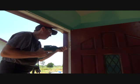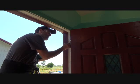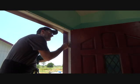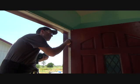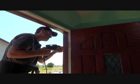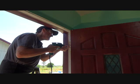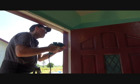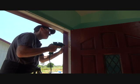Make sure you put them in the right holes, because we don't want to put them in any of these other four holes. And if you're thinking, hey, Joe, why not just take one of the screws out and ram a screw into here and be done with it? Well, you can't suck this jamb in far enough that way. We want to shove it in as far as we can, so that's why we're doing it on the back side. Then you won't see these screws. Make sense? I don't even care what color these are. I want to make sure there's a flat head so they go flush to the wood. I don't want the round head ones.